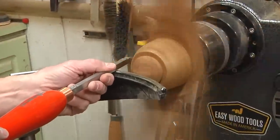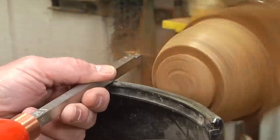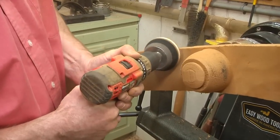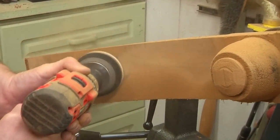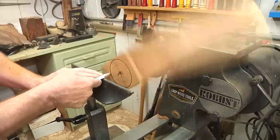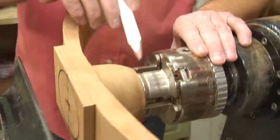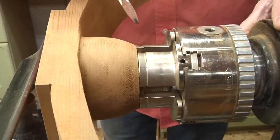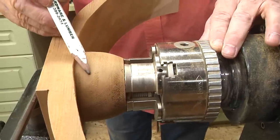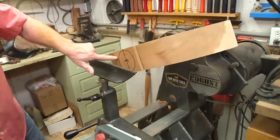Now I'm making a mark that shows how the bowl flows in here. This is the trick — this is why I put this little tenon here, because we're using the Easy Wood chuck extended jaws to hold this out since the piece curves down inside, so in regular jaws that would bottom out. When we flip it around, we're going to come back and curve this and turn away that tenon. But right now I'm going to work on making the shape for the top of the bowl.